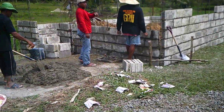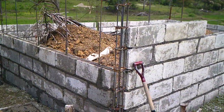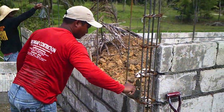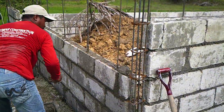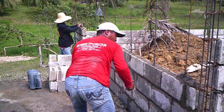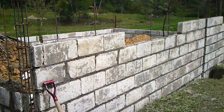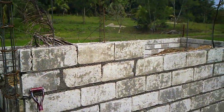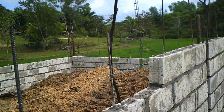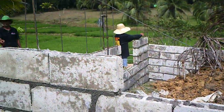You can see the rebar they're putting in, attaching it approximately every brick to every other brick. They do it completely different than in the States — this is how they build all the structures and they're really good at it. And of course they use a line level here to line up the bricks, which seems to be standard practice in brickwork.